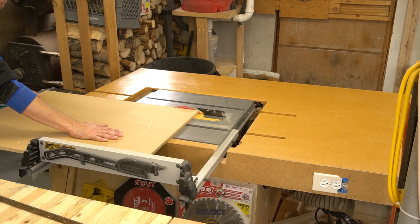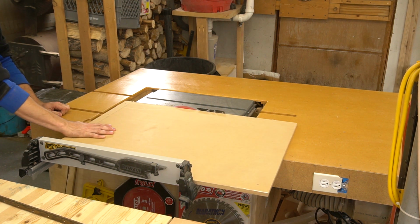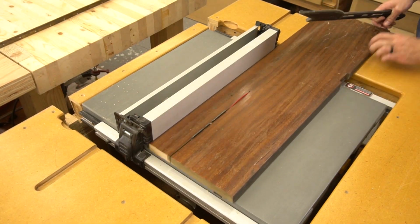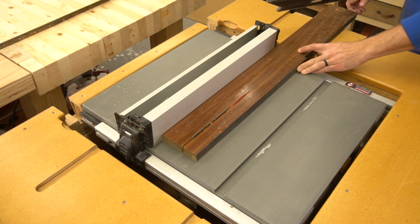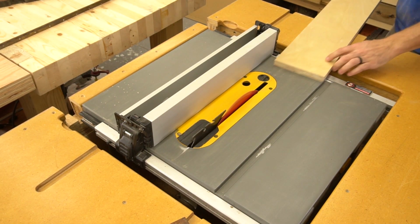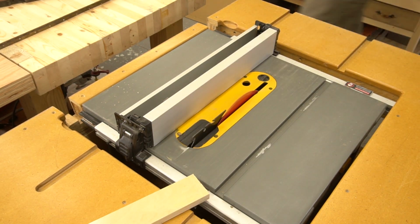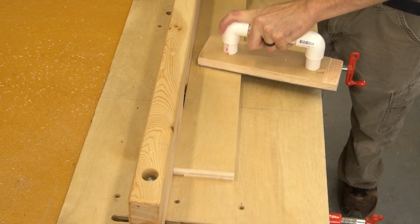I started out by cutting a large sheet of 1/2-inch MDF to size. This will be the platform that I base the whole project off of. Next I cut the frame and drawer pieces down to size. I didn't want to buy any lumber for this project, so I'm just using whatever scraps I can find from older projects. I left one of the frame pieces a bit wider than the rest so it could act as a kickstand. You'll see what I mean by that a little later.